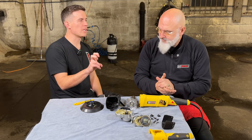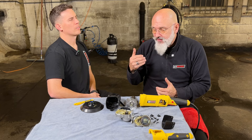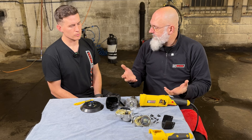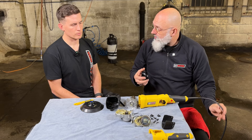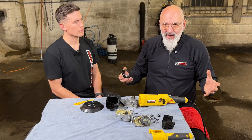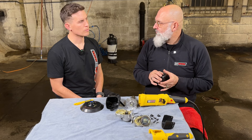What's the difference between this and a cheap machine? Cheap machines — there are some on Amazon for $80. The differences come down to: quality of the bearings, quality of the machining, tolerances — we have much tighter tolerance levels on our machining. We have double reduction gears, which cost more. We have a better fan moving a lot of air. We have this air management insert that a lot of tools don't have. We have a higher quality switch and much higher quality wire. Every component we could get at a higher quality, we did. Yes, we're buying in China — but in China you can buy tools two ways: I want a tool for this price, or I want a tool for this quality — what's the price? We went with: this is what we want, what's the price?